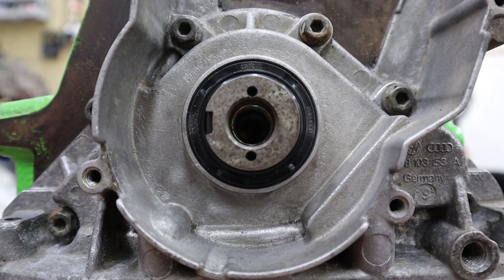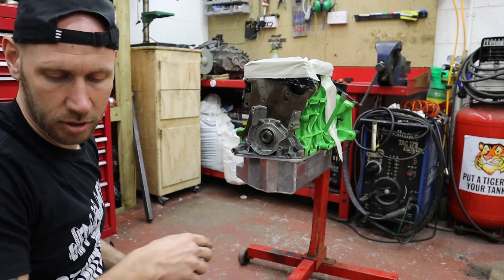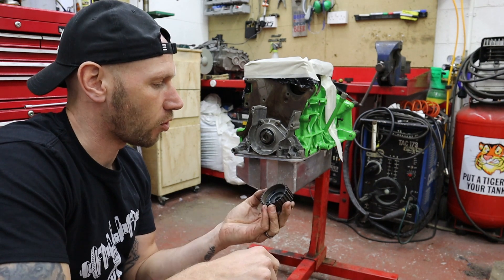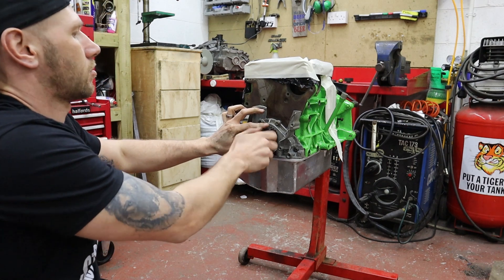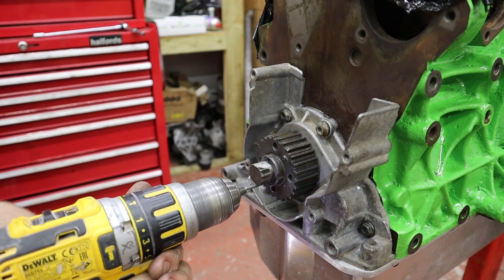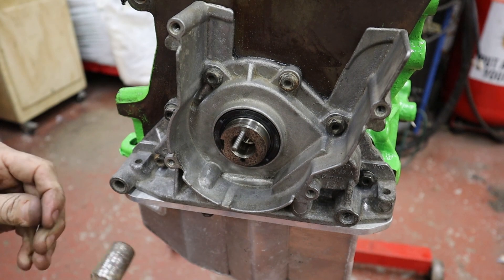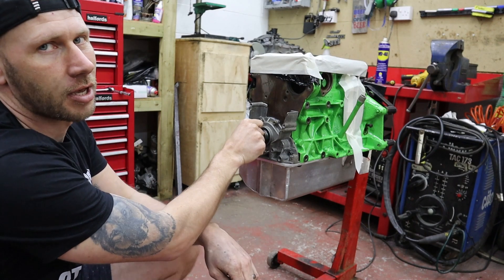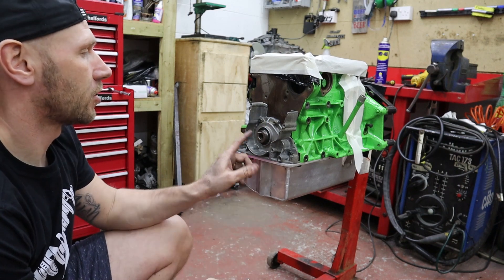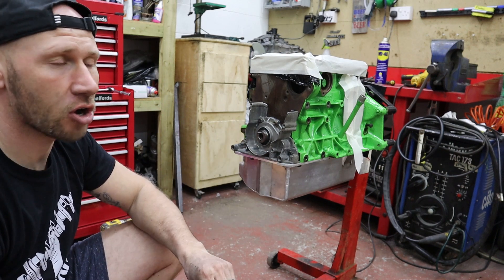Can you see what I mean about that top one? I was probably just a little bit too close to the inside of the bolt hole, but to be honest that's absolutely fine — there's nothing wrong with that at all. That's now drilled out to 3.7mm. I'll put this back on and we'll ream them out to 4mm. Boom — 4mm holes. Even though I've drilled two holes, I've only fitted one to start. That's because when you put two in, it can be a right pain to get the pulley on and an even bigger pain getting the pulley back off again. So I'll put one in, put the pulley on, then drive the second one in — and that'll be the pulley nigh-on locked on the end of the crank.